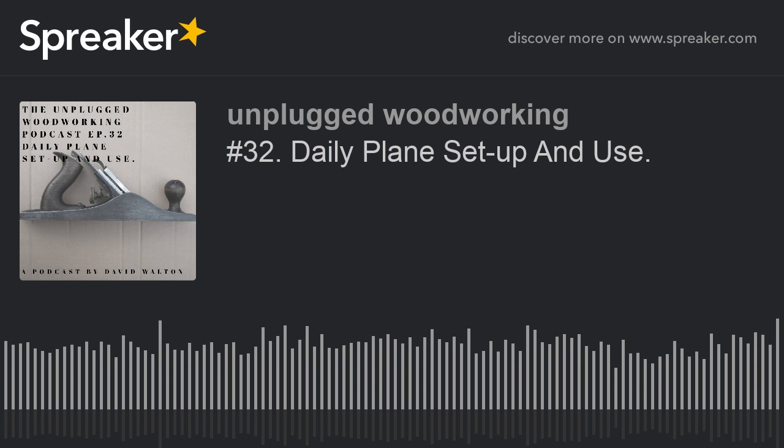I've talked about this before. It's not uncommon for me to use a Bailey number 4 to joint boards, in combination with a straight edge or a ruler. This is very common for me. Either that or the jack plane. I've never used anything bigger than a jack plane. I don't really think I would go out of my way to buy one.